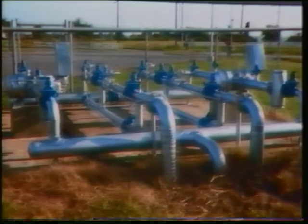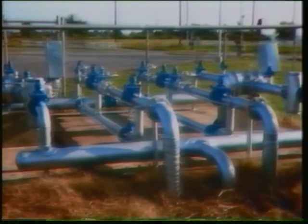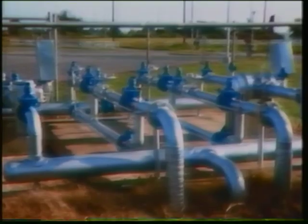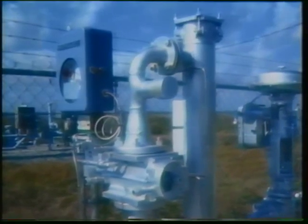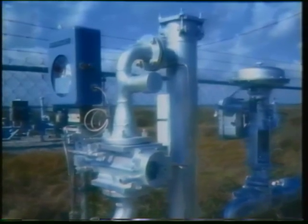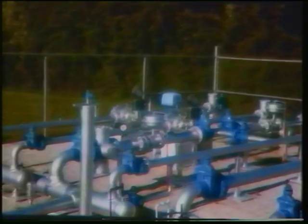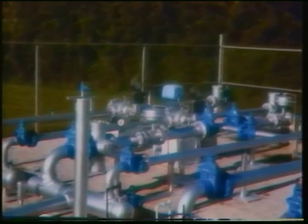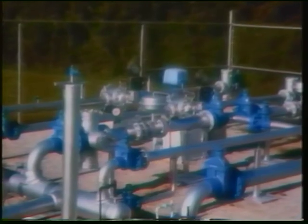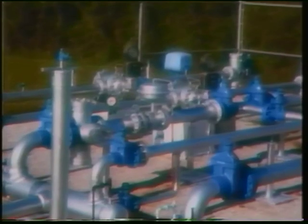In many cases, the total load will have many components, as in installations with multiple boilers, apartment complexes, or anywhere a large number of gas-fired units are downstream. Diversity factors should be used to prevent the meters from being oversized. Often, only a few of these would be online at any one time. Actual consumption would only be a fraction of total load, and a meter sized for total load would be oversized. Engineers calculate diversity factors that reduce total load and prevent the meter from being oversized.